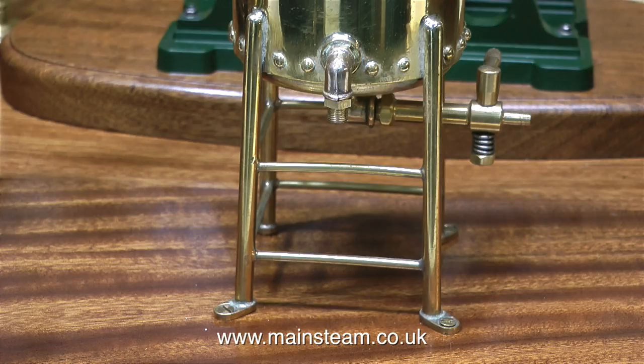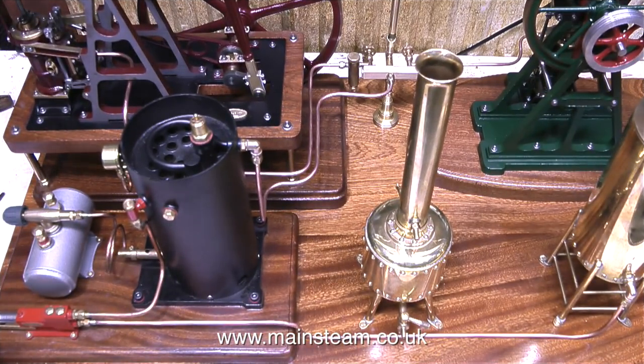None of these methods are applicable to small bore piping like I'm using here. Here's an aerial view of the plant — the piping is looking quite neat. The piping run I've just made from the water tank to the boiler feed hand pump follows the contour of the baseboards almost perfectly, and you can get an impression of what the plant's going to look like. My advice to beginners is to sit and think for quite a while before starting the piping job — then you will get it right first time. Thanks for watching and I hope you found it useful.